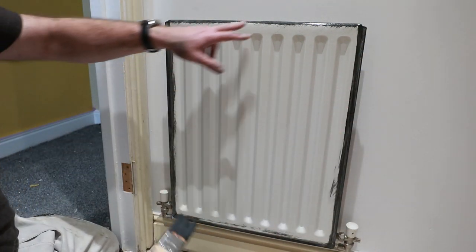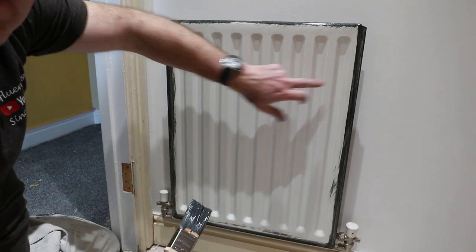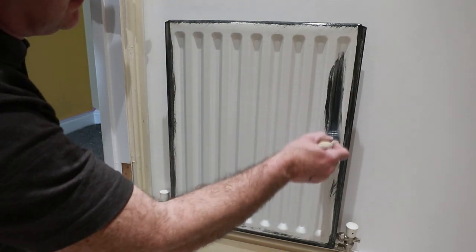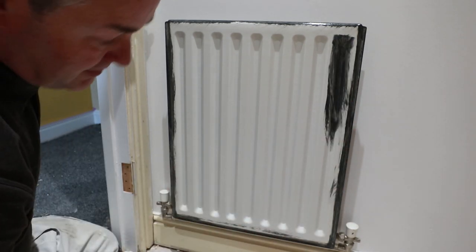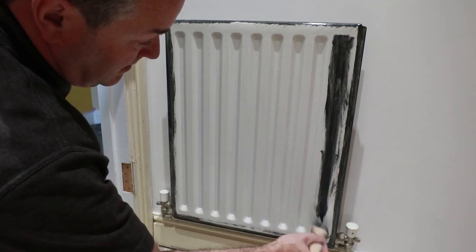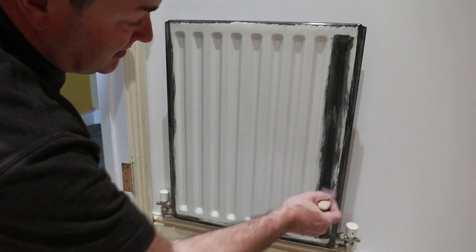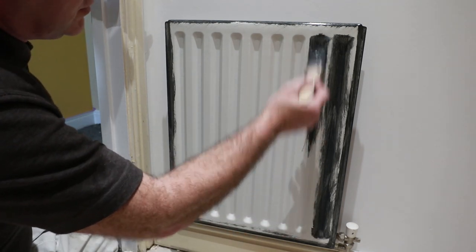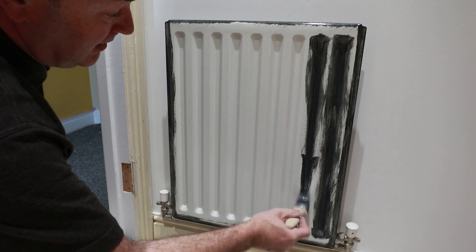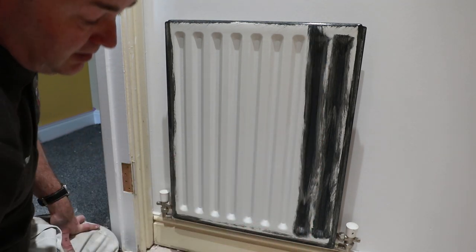We're keeping a wet edge, that's not dried off too quick, it's still wet. And now I'm bringing in these corrugation shapes, look, start in there, scrub them into those crevices like that. That's one. Lay off with the tips of the bristles. I'm going to bring a couple across at once, or I might bring three or four and then I'll show you. I'll bring three or four of those. There's two,